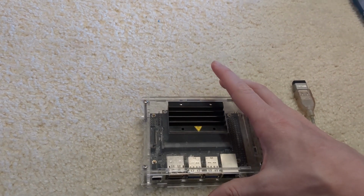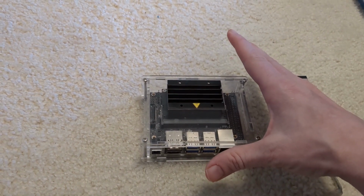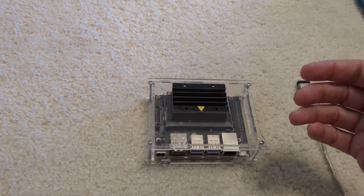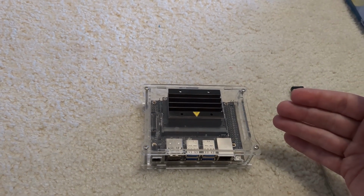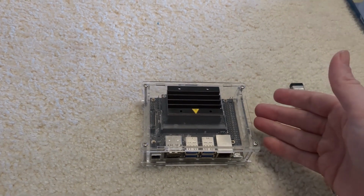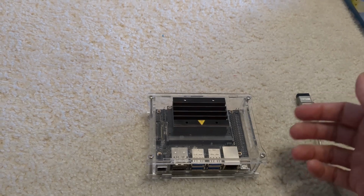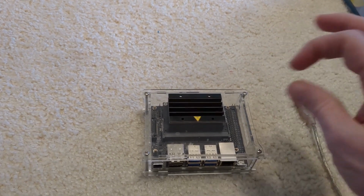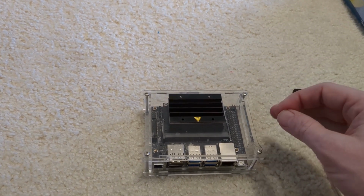There's a couple of things that don't work as well as I'd like, but overall, it does work. One of the real big problems I have with it right now is there's actually no way that I could find to install an APK without first installing Google Play services. So while you're flashing the board with Lineage OS, you also need to flash Open GApps. That's on the Lineage OS website, around the same location. Unfortunately that is a requirement, and it's not in the instructions, because technically it will boot up if you don't put Google Apps. The problem is there's no file manager. You can't put it in USB debug mode because there's no About section in the settings menu unless you install Google services first, which is kind of strange.